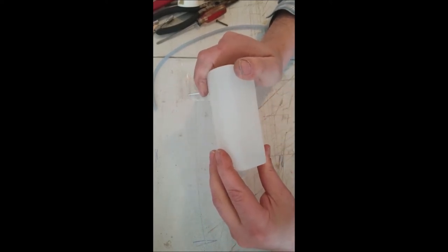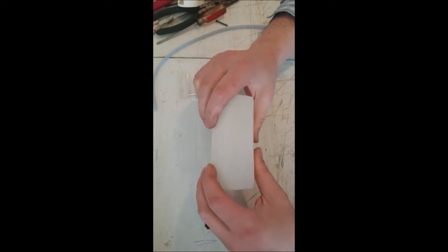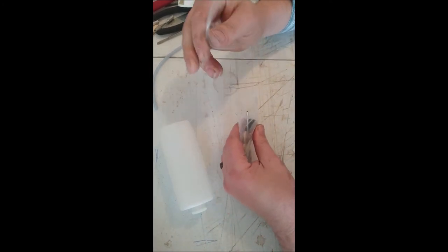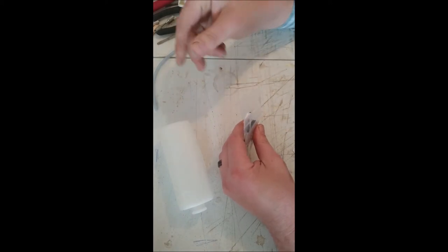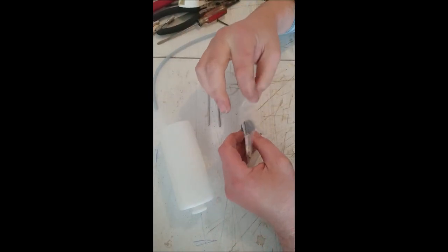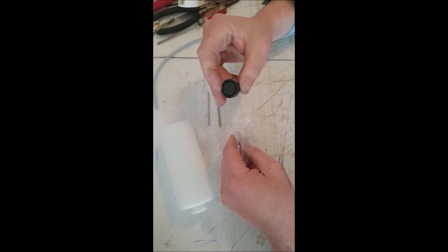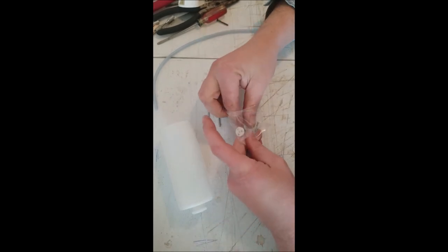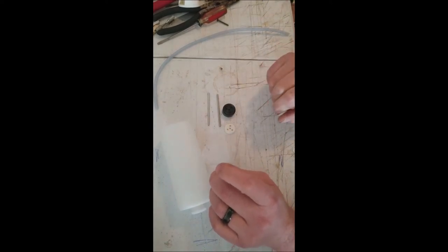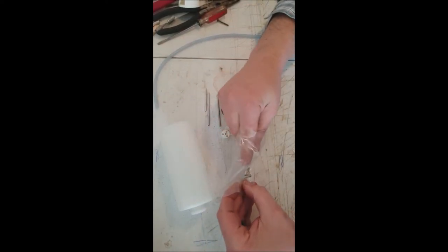It's been around. And this is a 320cc or a 10.5 ounce fuel tank. And this will buy you, with a Super Tiger 45, about 15 minutes of flight time. Now here's our hardware package. That's the fuel line that they give you to run inside your fuel tank. Pitch that. Okay, and there's our lines that actually go in and out of the tank. Our tank stopper. Yeah, they never did poke the holes all the way through, but that's an easy remedy. This is the front side. Oh, what was that? Oh, some sandpaper. And the back side of our fuel cap. Third line if we decide to run it, which we're not.